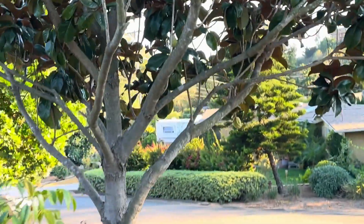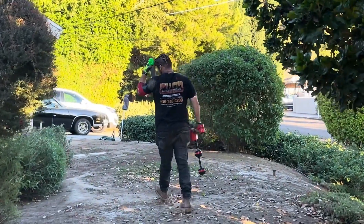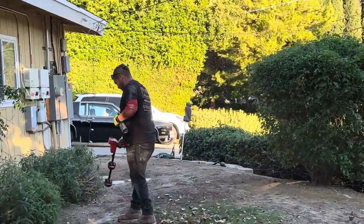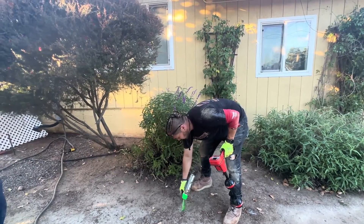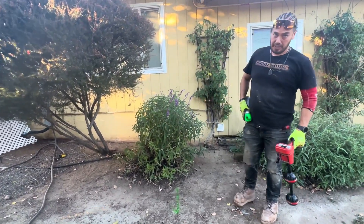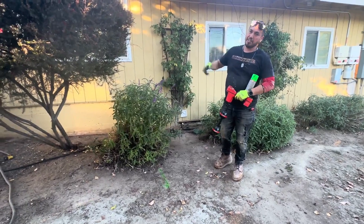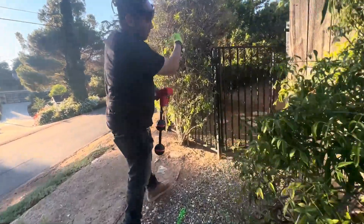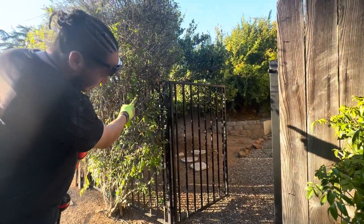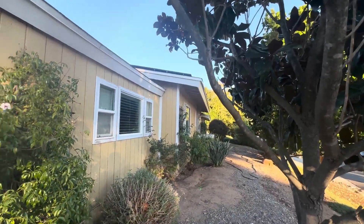Just in case the inspector doesn't allow us to use the existing connection, we need to know exactly how deep it is so our guys can excavate and find the main pipe. It's reading one foot four, so it's not that deep. We have about ten feet of drop to the street, so we should be fine. Coming from the ADU, the best tie-in is on that little hill — come straight down the hill at an angle, use 45s this way, and then drop into the main. Pretty straightforward.